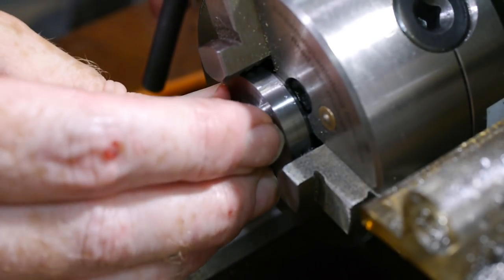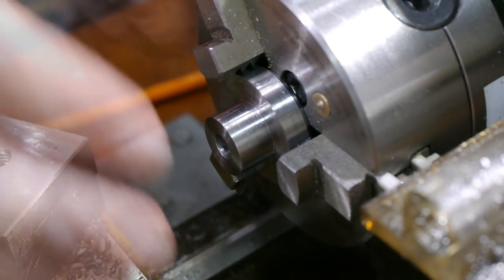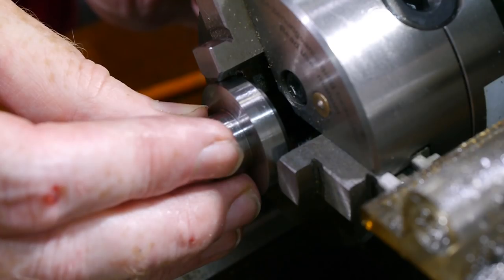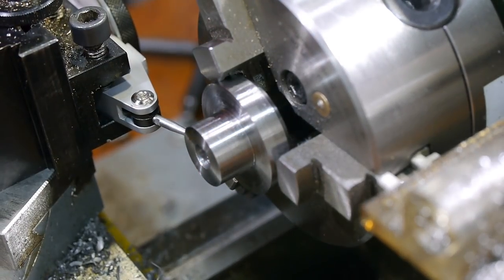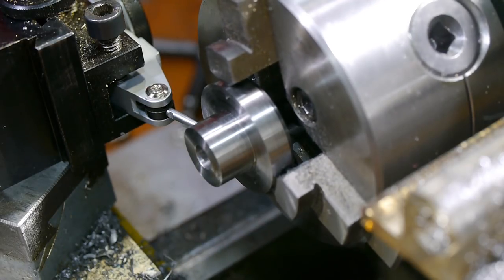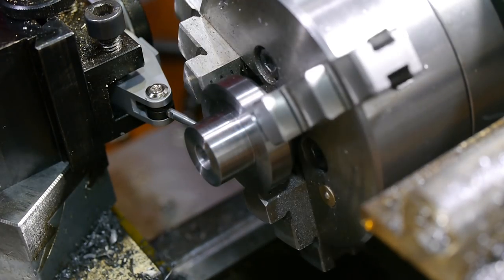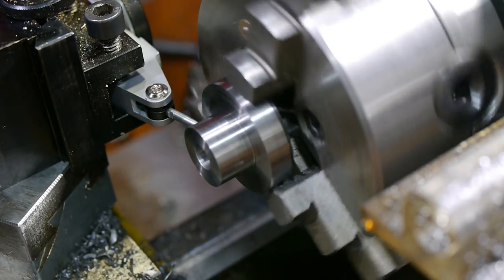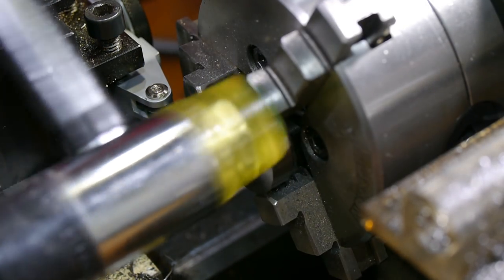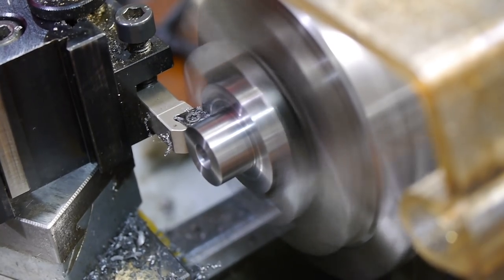Setting up the end cap to add the relief proved quite difficult. I originally machined all these surfaces before parting off from a larger piece of stock, so rechucking the part required me to deal with a much smaller holding area, and no easy way to ensure the part was true. I ended up chucking the part without any reference and then using an indicator to true up the face. I cut the relief to a depth of 0.2mm.